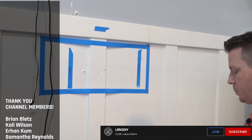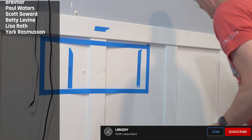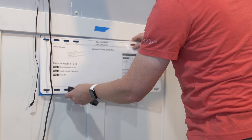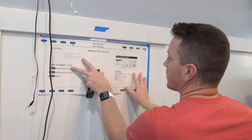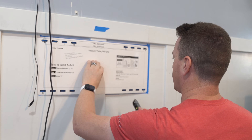Whenever possible, try mounting your TV mounting hardware to two different studs. Depending on the horizontal positioning of the TV, you may only be able to attach it to one — if that's the case, consider moving the TV over a few inches. But if you've got two lag bolts going into a stud, you're probably going to be just fine.